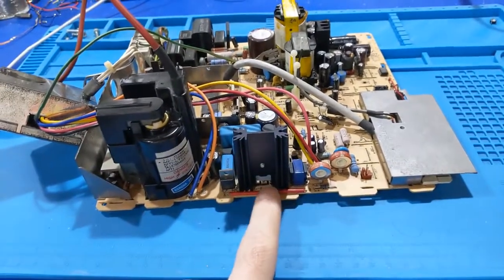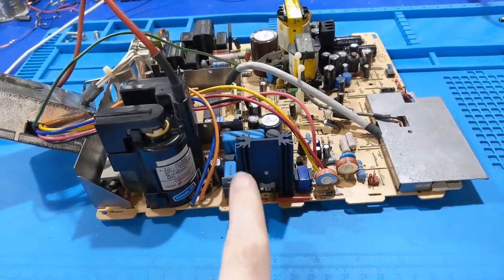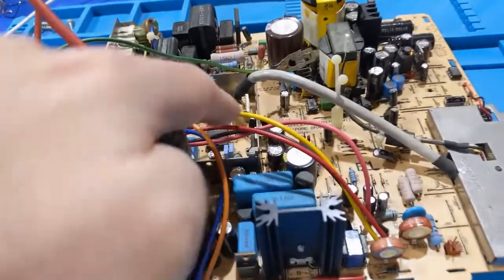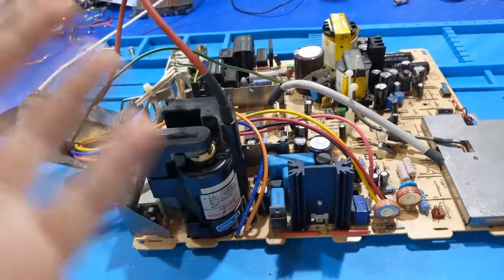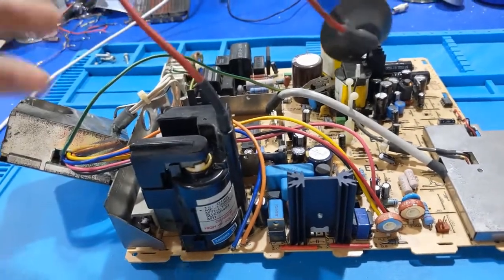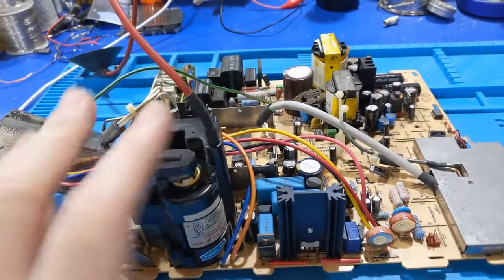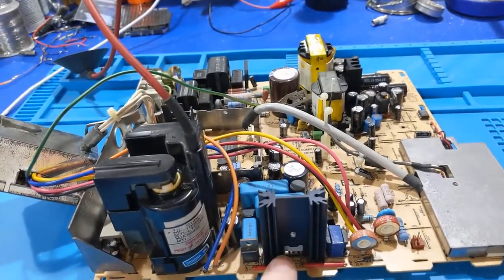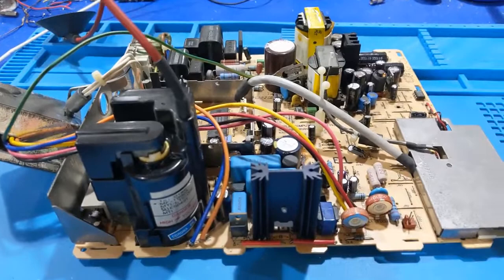So, what I want to do is check the drive signal coming out. Well, two things, really. I want to check the B plus voltage to make sure it's not spiking and doing weird things. But I also want to check the drive signal with an oscilloscope and make sure it's stable, because it's generated from this jungle I see back here. So, I want to make sure all of that is good, and I also want to prevent further damage. Even though this flyback is slightly different, it may or may not be compatible. I don't entirely know for certain. But considering the old flyback had issues and this one's doing weird stuff, I tend to agree that there's something still going on with the board. So, I want to remove this and check the drive signal, make sure everything is good there with the oscilloscope, and just keep an eye on what's going on with the drive signals.